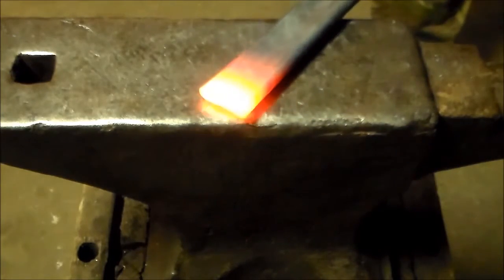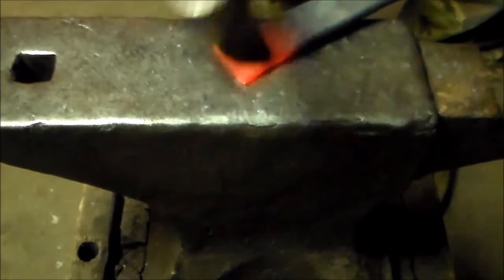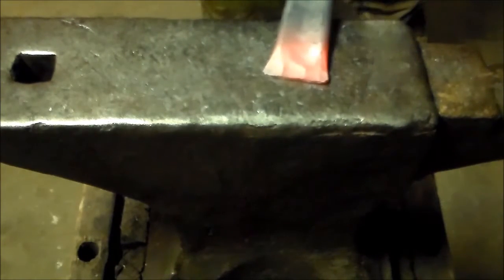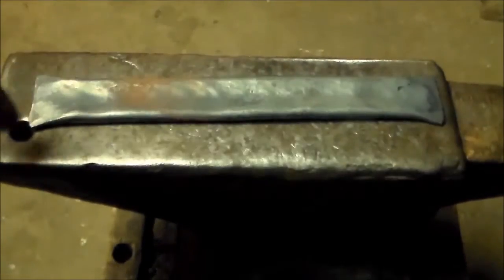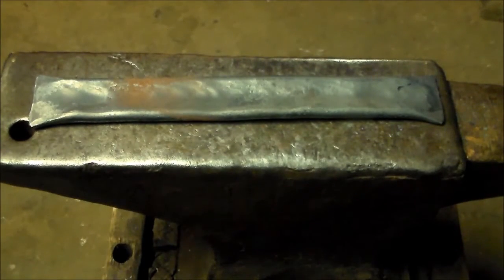The ends we're not going to get crazy with — we're basically just going to mash them flat. Got to flare it out and mash it flat. This is our piece of Schedule 40. We flared the ends, we flattened the pipe, we've got that nice concave dipped-in with the rounded edges look. Now we're going to drill some holes in that before we move forward. But before we do that, we're going to forge our three hooks real quick.